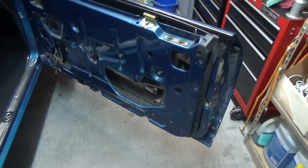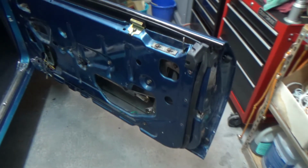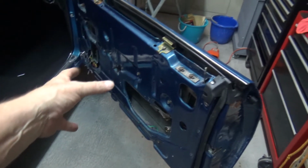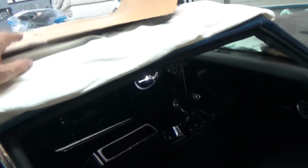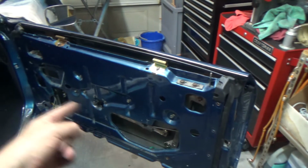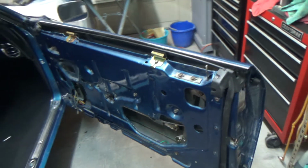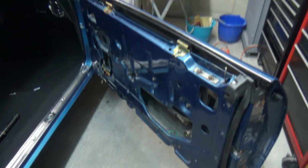I don't know what happened. The camera just stopped. So anyway, we'll get a 3/8 drill bit, drill those out, put nut certs in, put the weatherproof membrane back on, and get ready to install the panel. And then we'll go from there. More in a minute.